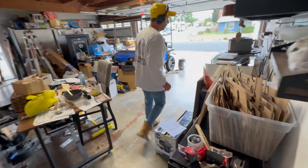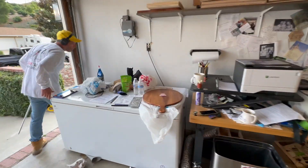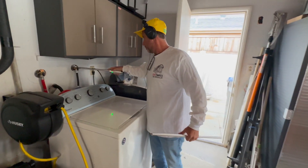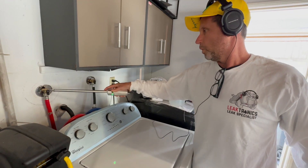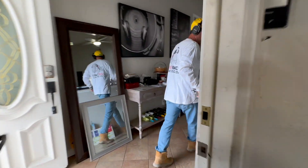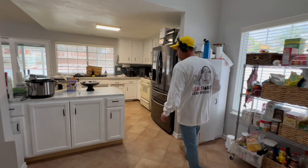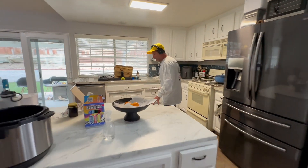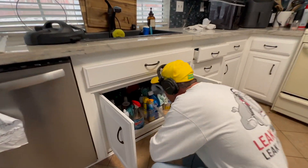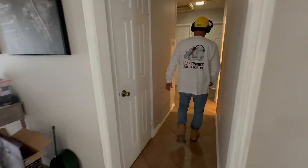When we get in the house we make a hard right turn, taking us through the garage. We're looking for any existing plumbing — there's a freezer that would just have a drain, no ice maker, and a washer/dryer setup. We put down our short probe; we don't want the long probe on the interior so we don't scratch drywall. We listen at the hot water heater, stay right through the living room, look for wet bars. We check the kitchen island — no sink on this island, but we look underneath. Then we get to the sink and touch the hot and cold shutoffs.